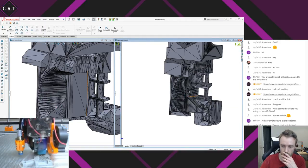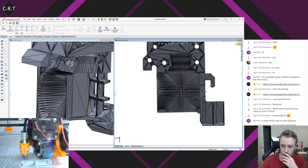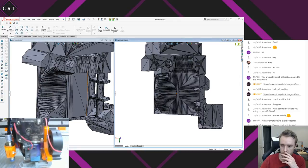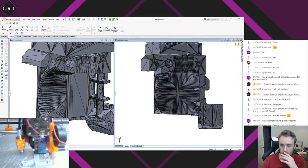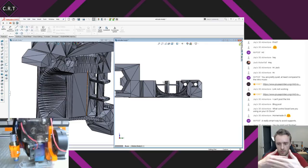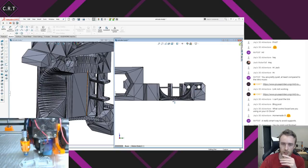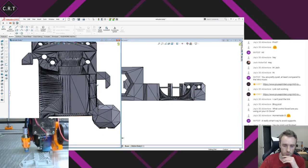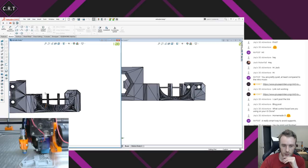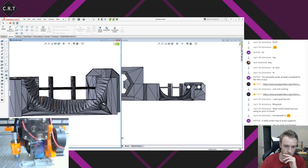Because you can see on this one on the right how the geometry is basically defined by a circle going this way to hold the extruder and a circle going that way for the airflow. But in fact, presumably that impeded some of the airflow because the hot end heatsink from this angle is pretty much a rectangle. So a cross section through the cylinder rectangle, sort of. So by having these edges here, presumably they're limiting their capacity to cool the heatsink, whereas on this one you can see how that circle has become much more rounded. So they cut out here and here, right down into the corners as far as they can go. Not sure why this one's further up.